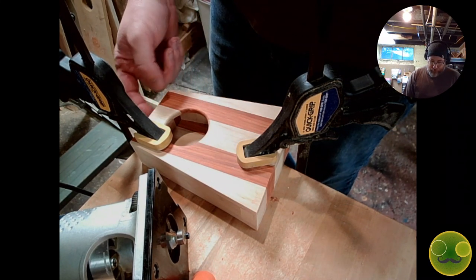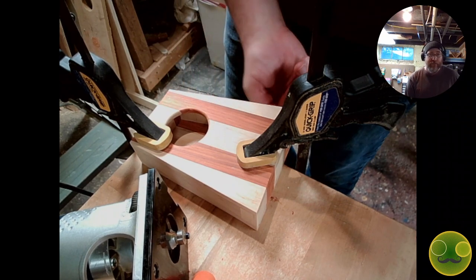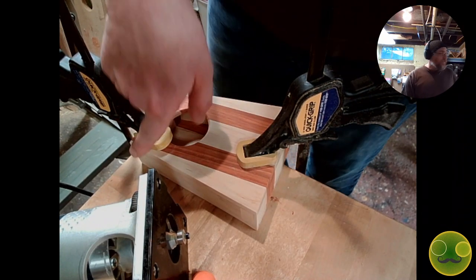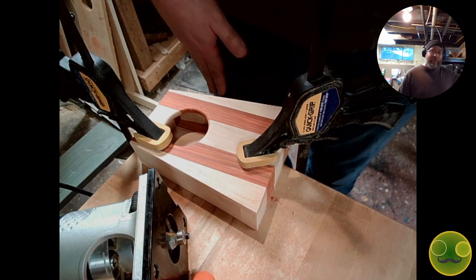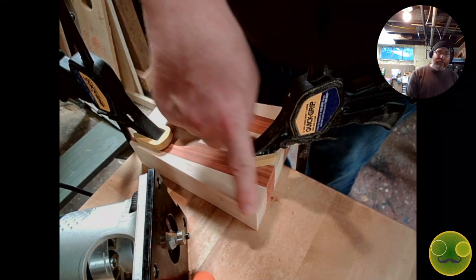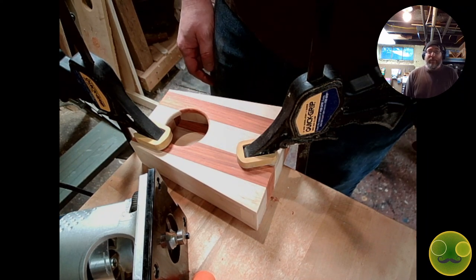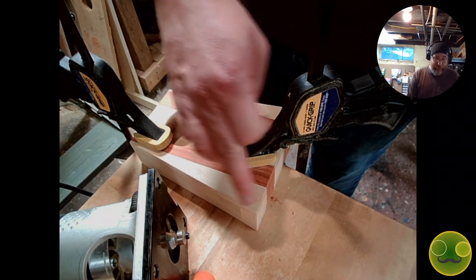And then I put the frame pieces together. Last time I just cut the frame pieces, but I didn't actually cut the angles on the side walls. So these side walls basically had to be cut. It's the same 8-degree angle, but it's the complementary angle, because it's meeting into the 8-degree board that's here. So it's 90 degrees minus 8, an 82 degree cut. And then I glued the frame together.